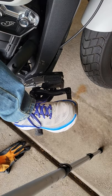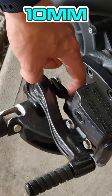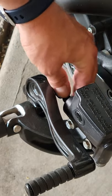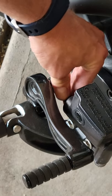Another common maintenance item that gets missed a lot is adjusting the foot brake pedal. Right here you have a lock nut. Once you break that loose, you can spin it all the way to the top of the rod and just keep turning that, and you will end up lifting the brake pedal.